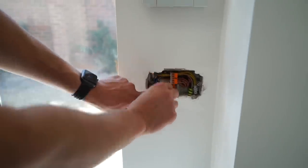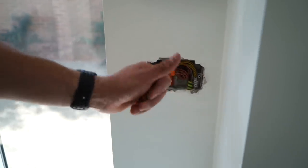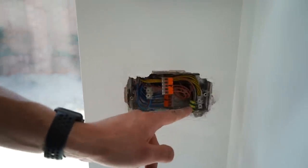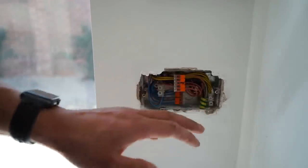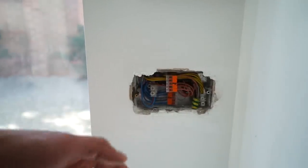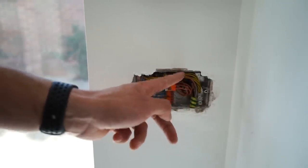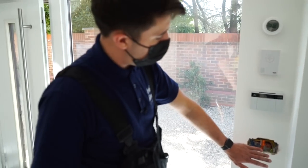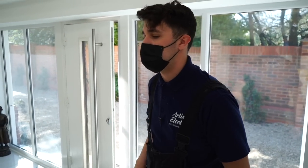I've disconnected these two-way switches at the other end and stuck a little label on it - this was fed from the other end, so it's dead now. I've chopped all the copper off, taped it up and pushed it out of the way. I never want to chop a cable out of a switch, because you never know when someone might need it. I'll just leave it in there - these are all the ones I need, and I just need to get a blank plate. We can put the Pico switch mounts onto that and work through all the different switches doing that.